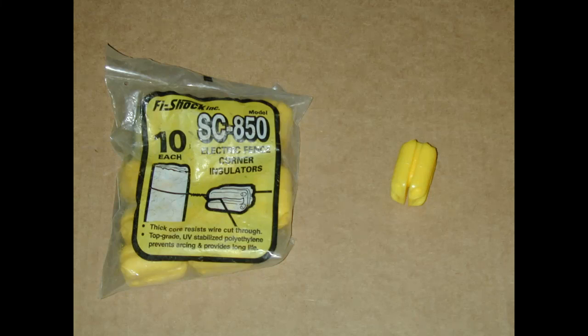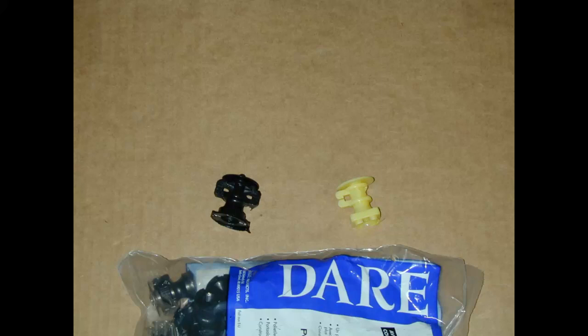They're even good for HF transmitting antennas. It's a good, cheap way to have a reliable insulator in a transmitting installation. So they're not just for beverages. And these are really good post-type insulators. You can nail these into the sides of trees or into wooden posts or pressure-treated lumber that you might use to support the antenna along the length. These are very reliable insulators.